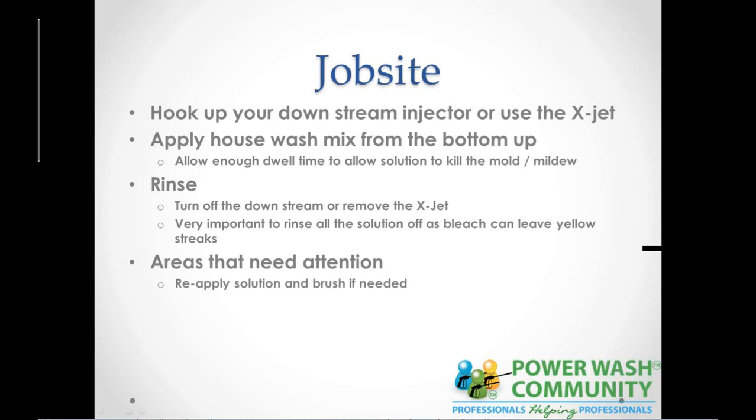Okay, spectacular. Just a little background. I've been pressure washing for years, and so I try to support in any way possible. Everything's super good as far as the material that's come across. But I would like to put it out there that you can use hot water on vinyl. I've been using hot water on vinyl for 3 years, as long as you're able to control your temperature settings and keep it between 60 and 70 degrees, which is just enough to heat and activate the chemical so it works a lot better.